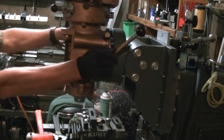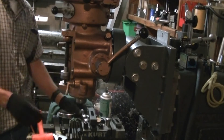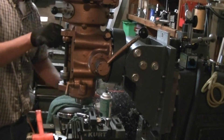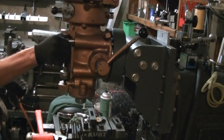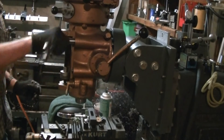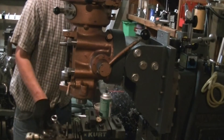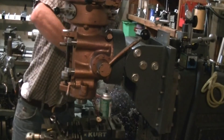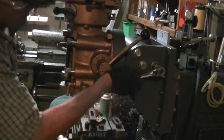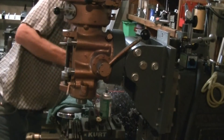The vertical head onto the mount should be a one-time operation. Since I've got it together, I've taken it off a couple times to use the mill in horizontal mode — I put some mounting lugs on the vertical head, bolt it on some little plates that I can hook a chain to, pick it off with the engine hoist, swing it out of the way, and then set it back on. When done you have to re-tram, but that's kind of the way it is when you move any mill head.